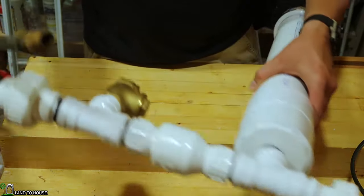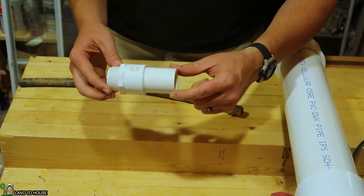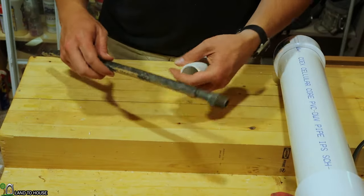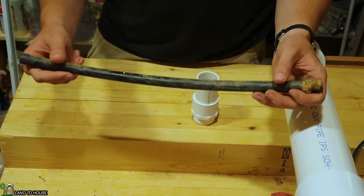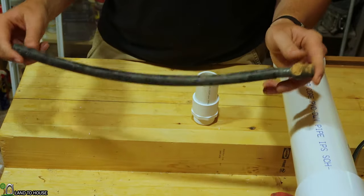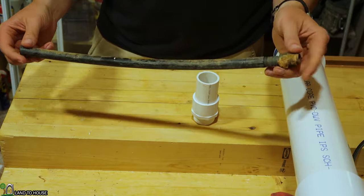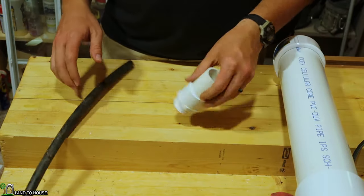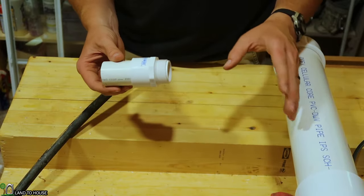Just a word from my experience: the PVC drive pipe is going to be far superior to a drive pipe made of poly pipe, because when that pressure wave starts kicking, the poly pipe will jump and you'll lose a lot of potential. As a delivery pipe going up to your final storage tanks, poly pipe is a great choice. But PVC is by far the better drive pipe to operate the pump.